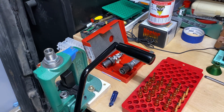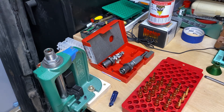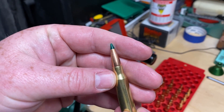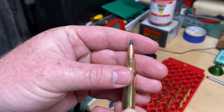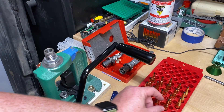The only reason why I use this on my hunting ammunition is: if the rifle takes a fall or anything like that, I want to make sure I don't get any bullet setback. I want to make sure that bullet is held in place and has consistent neck tension across all of them — that's the main reason why I like the factory crimp die for hunting ammunition. I'm just going to run these through, and it's literally just going to kiss the neck ever so slightly. You can see right there — just that small little ring, barely an indentation — but it is going to ensure that bullet is not going anywhere. Hunting is definitely a more harsh environment than any match can be, and I just like having that on there for peace of mind more than anything.